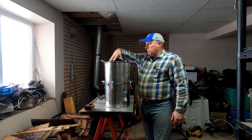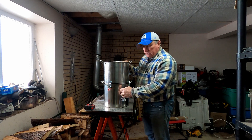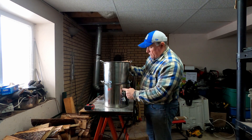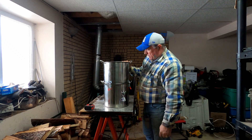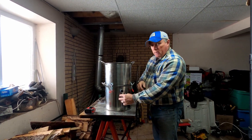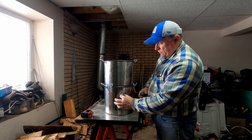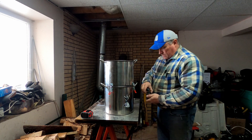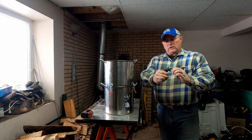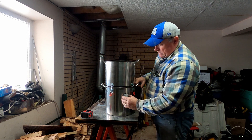Now what I need to do: obviously the syrup will be poured in the top, so I've got to put a vacuum line into this here and then a drain spigot at the bottom. We'll put our vacuum line in first, so we're going to have to drill this again with a much larger hole. You want your vacuum line tipped down — because if you don't tip it down, when you pour syrup in it's going to come into your vacuum line and you don't want that. So this goes on the inside through a bulkhead fitting, and it creates a vacuum in the bottom piece.